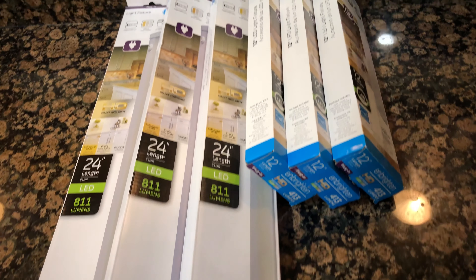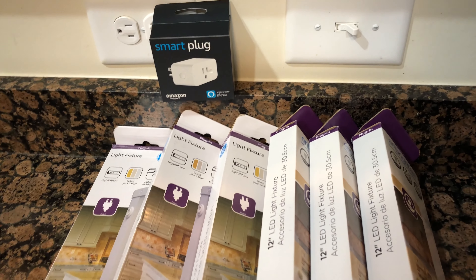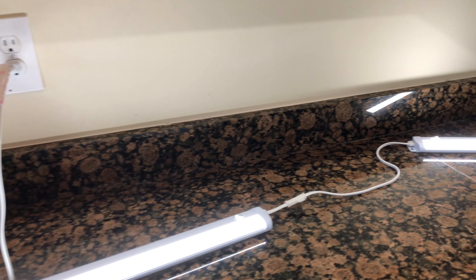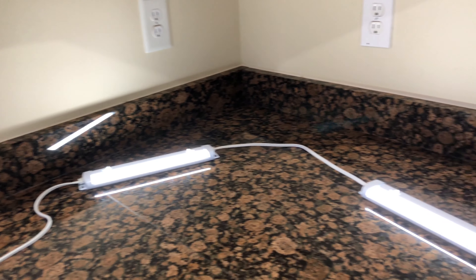Once you orientate your lights and lay them all out, one thing I noticed: you cannot go from a shorter light to a longer light on the power source strip — at least with this kit. As I extended the lights out, I was going to go with a 24, a 12, 12, and then another 24 because my cabinet boxes are 30 inches wide. But coming off the second 12, I had to add another 12 because the power wouldn't support adding another 24. So on this side we're going to do two 24s, and on this side a 24, 12, 12, and 12. I did a mock-up and held it up to make sure Mrs. Remote Life was happy about it, and she liked it.